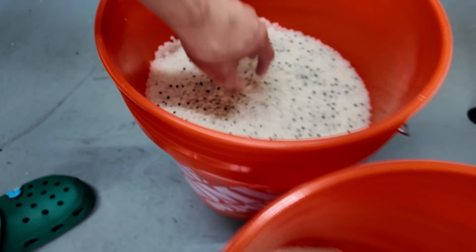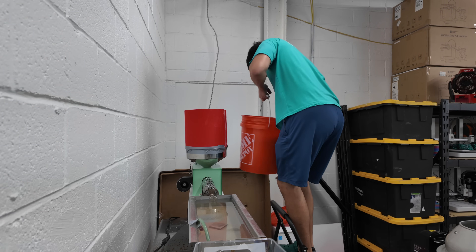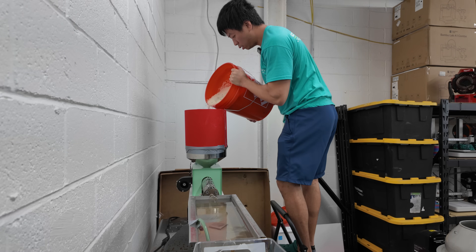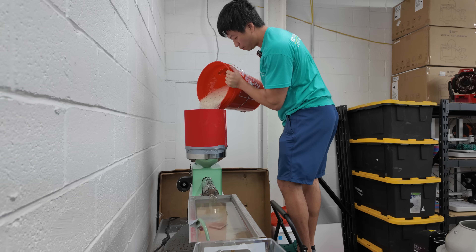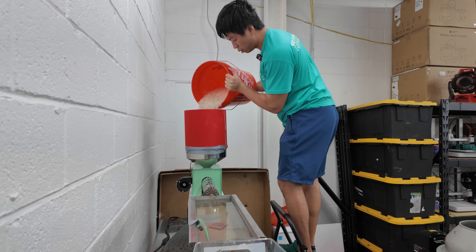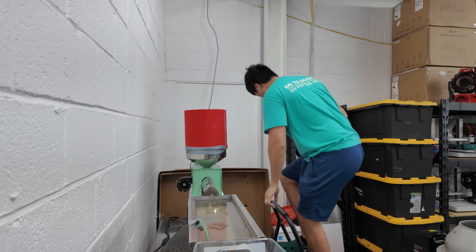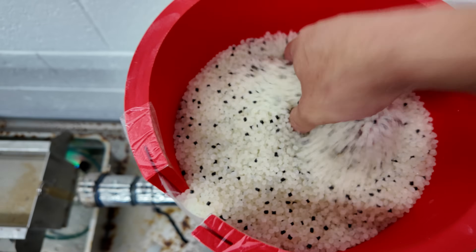You can see that towards the top of the bin it's not mixed very well, so I hand mix it when pouring. I combined both bins into one and pour it into the hopper using a step stool. This actually produces quite a bit of static, and you'll see the resin pellets jumping around everywhere because of it. That's essentially a full hopper — what we'll use for the whole day, which can produce around 10 rolls.